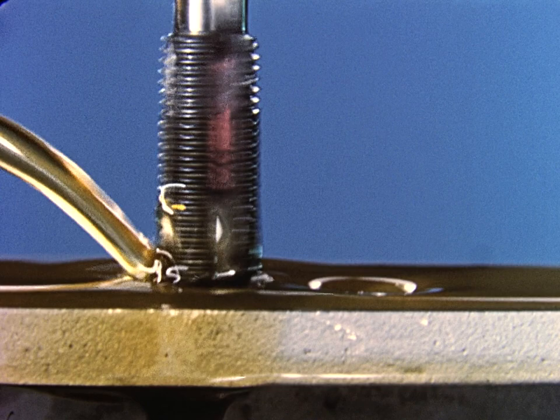There comes a time when even a properly used tap must be resharpened. This means re-grinding a surface following the contour of the relief on the chamfered teeth or the cutting face on the land. However, it is easy to resharpen a tap on machines designed for this purpose. So far we have considered what a tap is and some of the problems involved in getting a good internal screw thread. We have also seen that interchangeability of parts is the key to modern mass production.